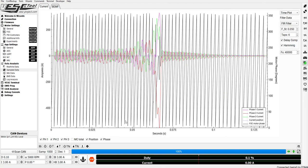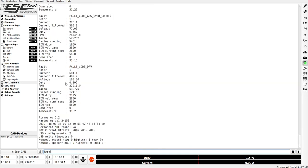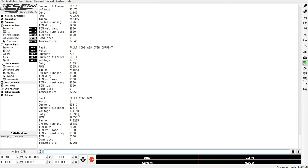As we can see, it goes well beyond 400 amps here — probably more than that. What we can see is there are faults here. The current actually goes all the way up to 653 amps registering — that's where the fault is triggered. That happens at around 29k eRPM.